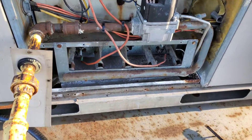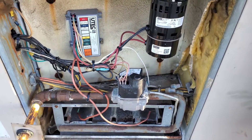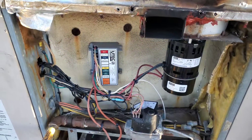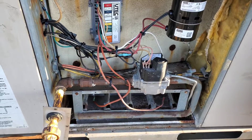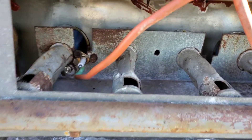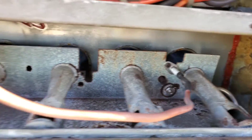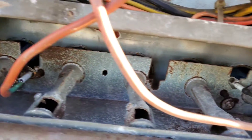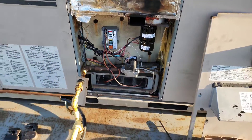It's all up and running now. I did check the gas pressure — sorry, I didn't take any footage of it, I've just been doing a lot of stuff here trying to get on the road. The gas pressure is at 3.5 where it should be and we're running nice. Got a nice flame there. Some wind is flopping it around a little bit, but everything's all fixed up and we're ready to rock. Happy HVACing!